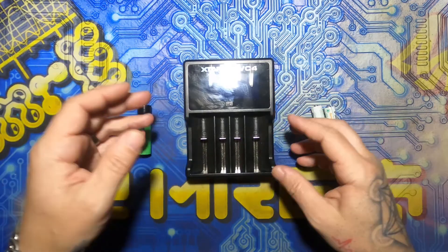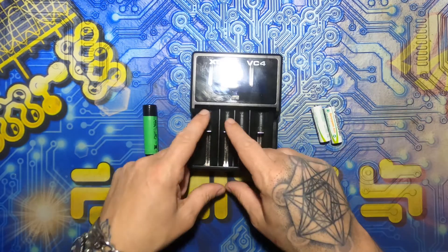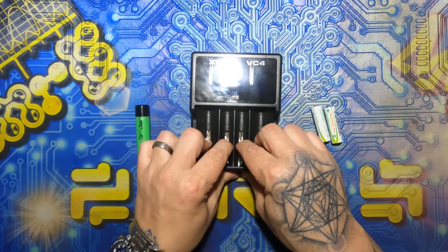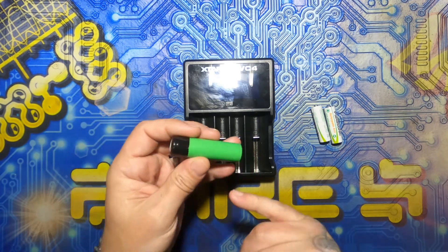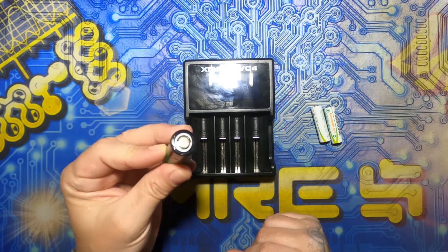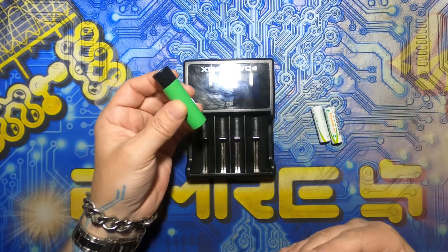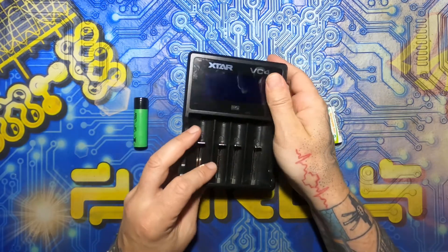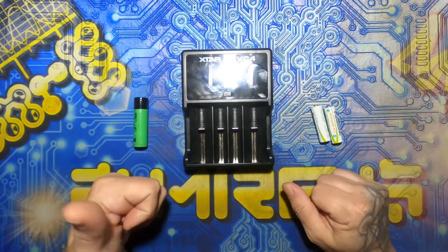The lights change when you're done — you get a green light and it will flash 'full' and show you how many milliamps were put into the battery. The VC4 is really so simple to use. I've been using it for a couple of weeks now — the spring-loaded negative ends are really heavy duty. I've checked a couple of fully charged lithium ion batteries and it came up 4.195 to 4.197, so it's not even a tenth of a volt out on its final charge. You can't go wrong with it — get yourself one if you're thinking about it, well worth it. Thanks for watching, any questions I'm always happy to answer — take care, see you later.